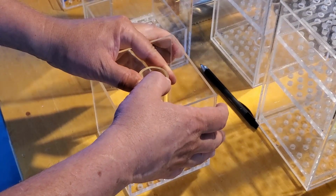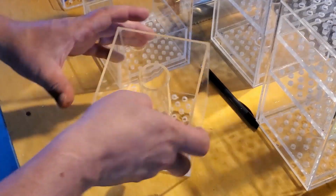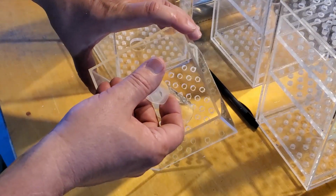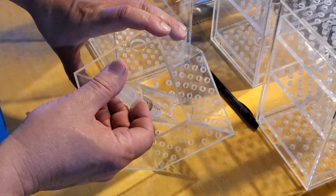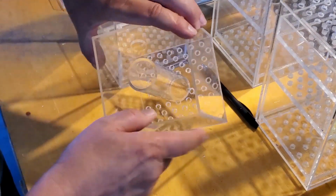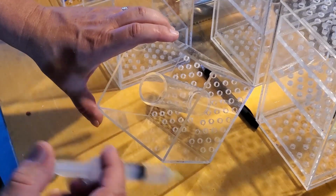So this is a very straightforward weld up. And the nice thing about this pipe and the holes I've drilled now, there's only one friction fit, and that's the one on the bottom plate. The actual positioning of this is not critical, and it doesn't really take that long. So it is, like I said, a much bigger, better improvement over the old style of doing these. And that's pretty much the entire build.